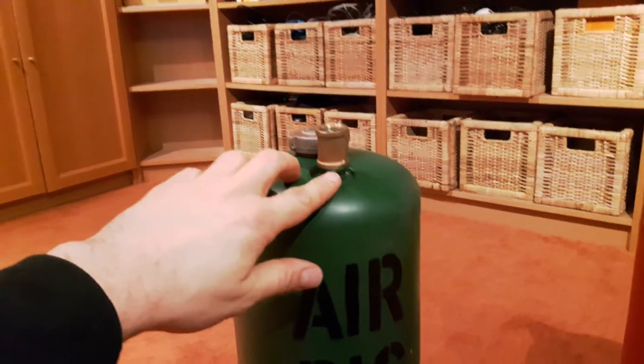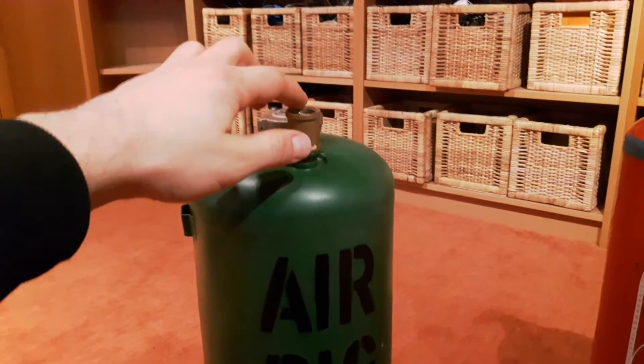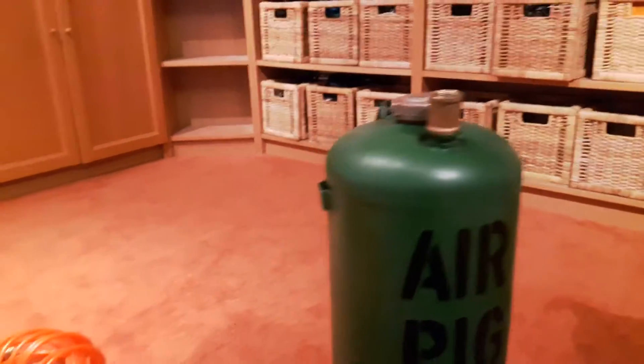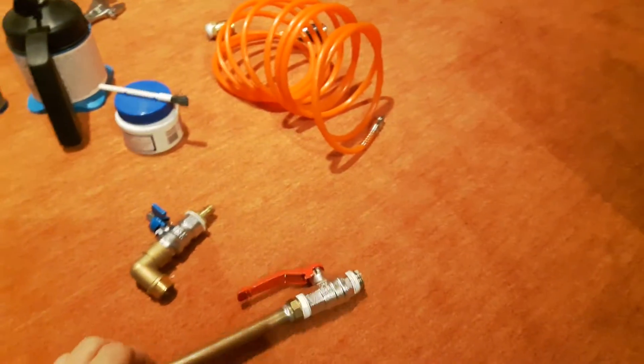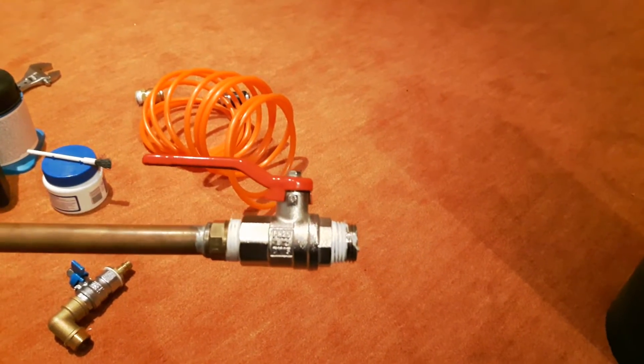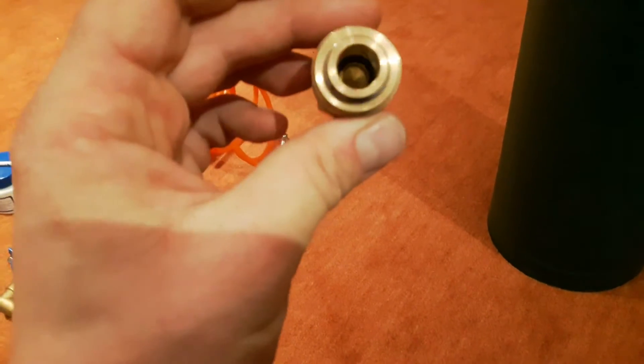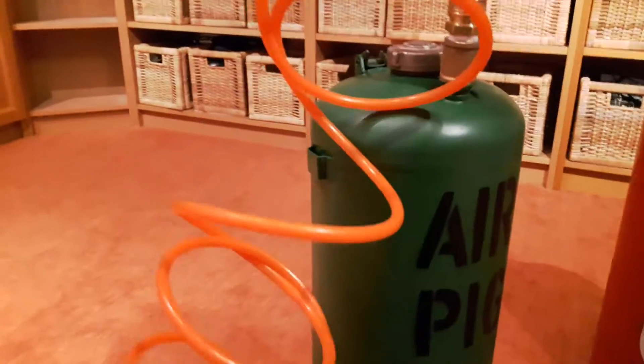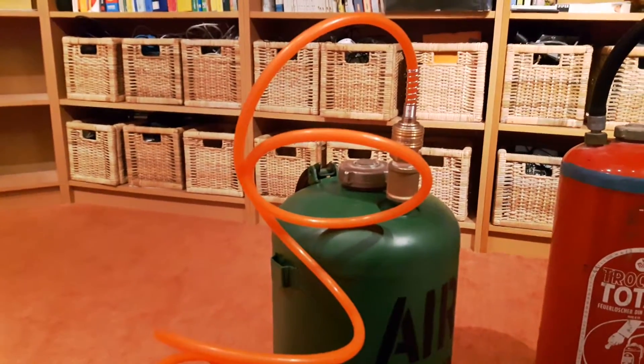For convenience, I soldered a little pipe with a ¾ inch thread on the top. So now I can use this standard ¾ inch ball valve or something else like this Euro-style connector on it. You can screw that easily on, and then you can put your tools on that bottle — whatever you need, for example a blowout gun or something to inflate your tires.